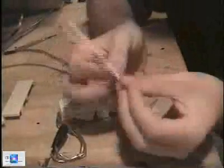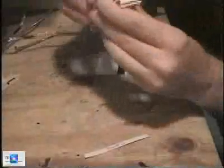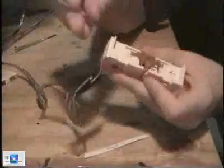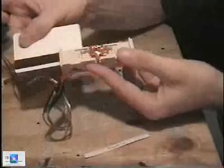Now, how do we read the other tracks without having to unscrew this? We've got these little shims of PVC. We take one of these shims and slip it right in there. Now the card can't go in as far — we're no longer aligned to read track three, we're now aligned to read track two. And it just swipes right through, nice and easy, just like that.